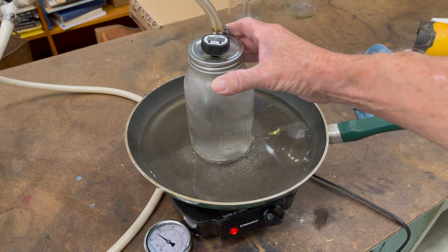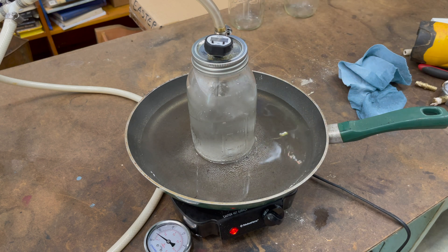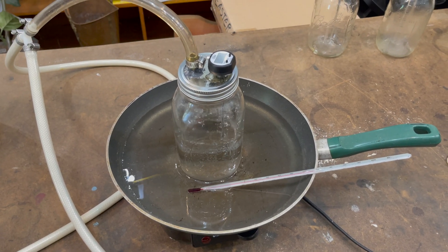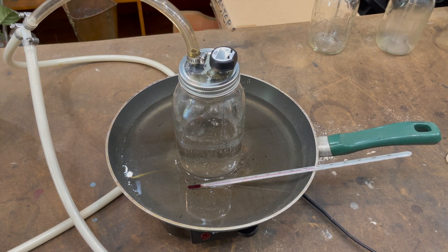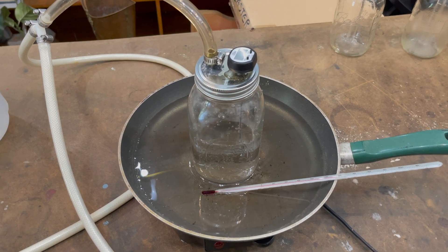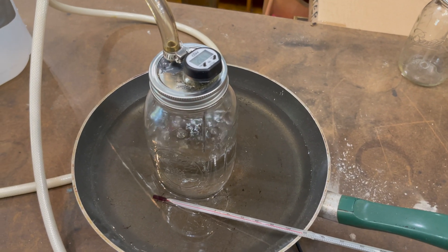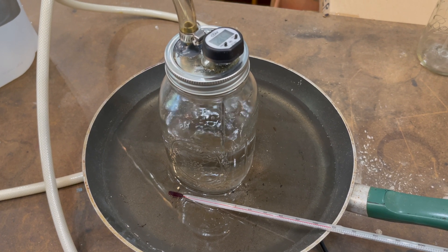We'll add a little bit of heat and see what temperature it takes to really boil. We're at 28.8, 28.9, 29 — I call that boiling. We were able to boil water under vacuum at room temperature with both the vane type pump and the vacuum water aspirator. The vane pump does better. In past work I've seen a big difference between them, but you can do both. You might have to add some heat using the vacuum aspirator compared to the pump, but it will work.